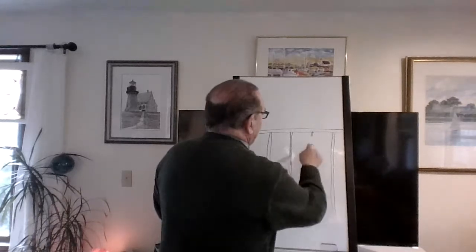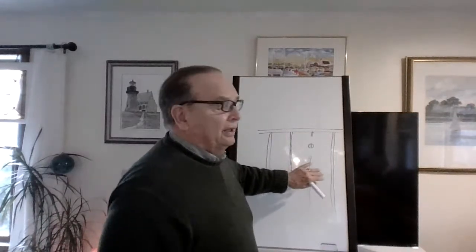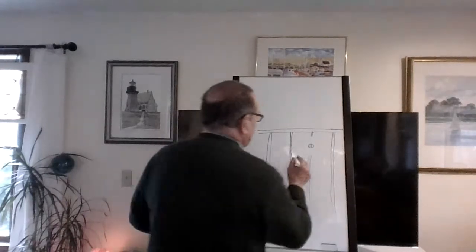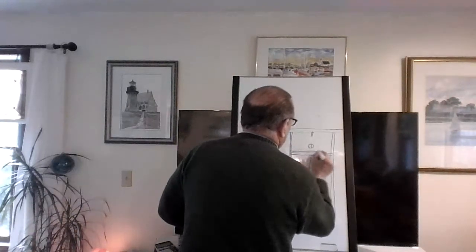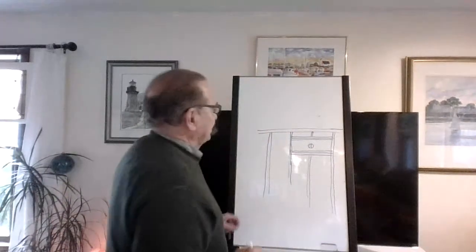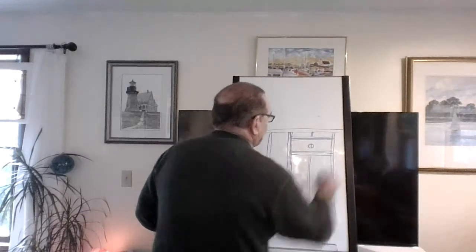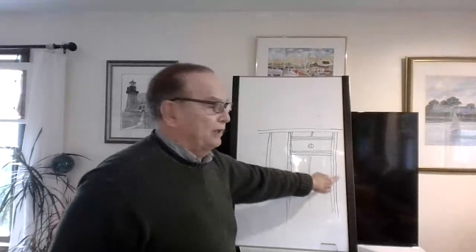Do your thing. Now, if you're going to keep it up above, inside the floor up in here, he better be aware of that because you're going to be going one way or the other, and he needs that space. So what he does, you've heard this term, head it off, right? You're going to head it off. Probably should double it up. Haven't been an inspector in a very long time, but I think you're supposed to double it up. But yeah, maybe not there, but here you do. Now watch this. This is where he has to double it up. So he's got to double up over here. So keep that in mind because you might have something going on over there yourself.